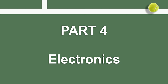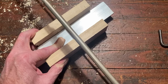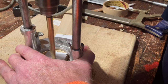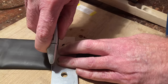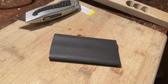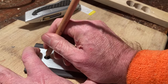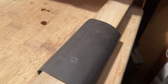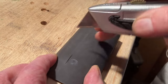Now it's time to assemble the electronics. Grab your aluminium flat bar and cut a four-and-a-half inch section. Attach pattern E1 and drill in accordance with the pattern. Now cut a four-and-a-half inch section of heat shrink tubing. Use the holes you drilled in your aluminium strip to mark corresponding spots on the tubing. Using some scrap wood placed inside the tubing, cut the holes in the places you marked.